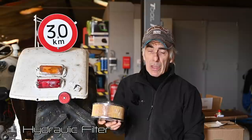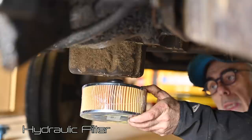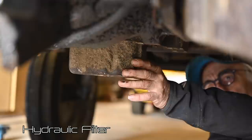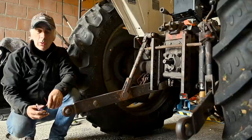We've covered most of the elements that make up the hydraulic system and the different operating modes, but we forgot one — the hydraulic filter. Here is that hydraulic filter, fitted all the way underneath the gearbox. You will find a metal housing where this filter sits. You'll have to remove the housing to get to it, and inside there's even a little magnet. It's a pretty important part — some of those tractors actually have a warning light to indicate when the hydraulic filter needs replacing.